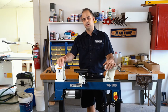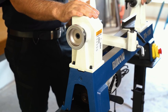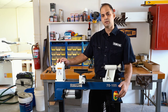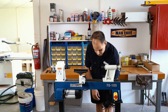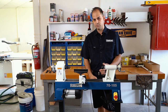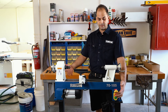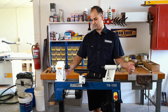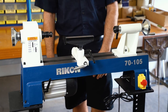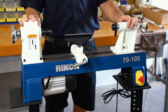As you can see, the lathe runs very smoothly. Because all the components are cast iron, you get almost no vibration through the lathe, which gives you better accuracy when turning small projects. The machine also has a no-volt relay switch, which means if the power is disconnected and comes back on, the machine won't start up unless the operator turns it on again. This is especially important for schools — it prevents a dangerous restart if someone was in contact with the machine.